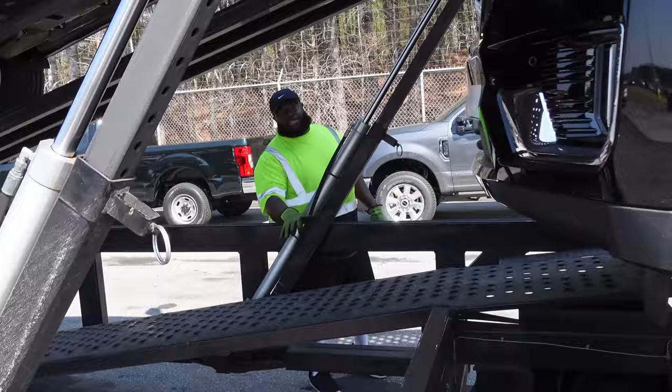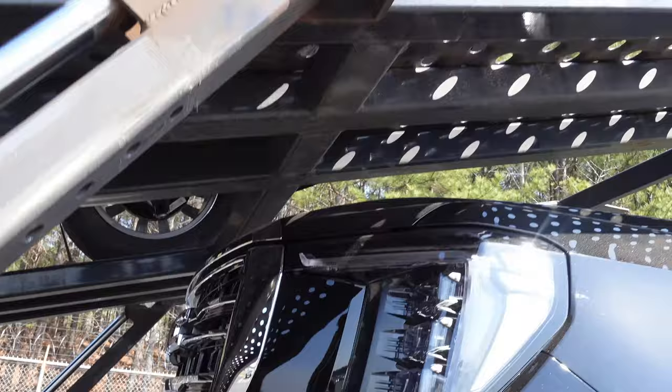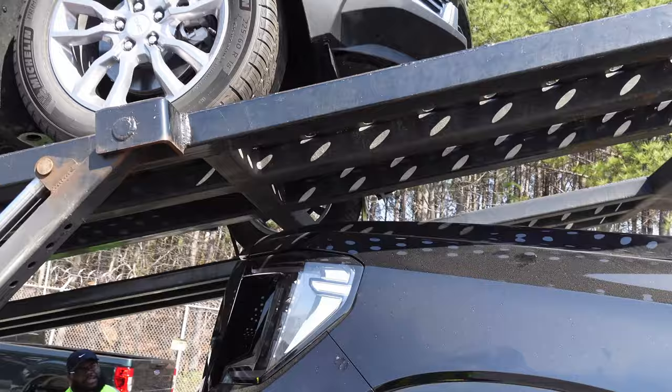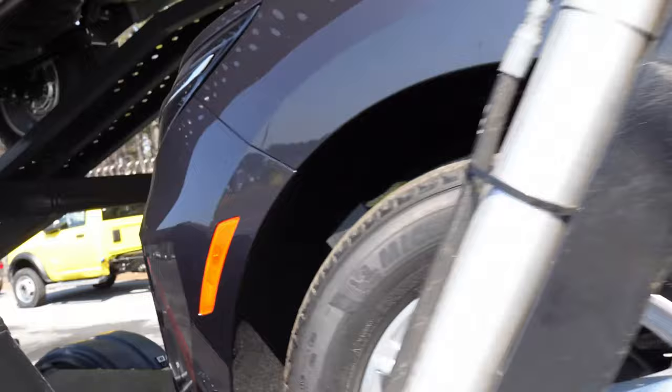And guys, what I want to show you, well, I'm not gonna get my big tail up here and show y'all, but as y'all can see, man, position four is highly tight. I want to leave a fist of room between that top railing and the truck, okay? So y'all can see how much clearance is from the truck and that top rail. Long as I got a fist of room, that's all I need. We locked and loaded. So I'm gonna show on this next deck up here. This next deck, I'm already kind of tall. So what I'm gonna do is drop my pins.